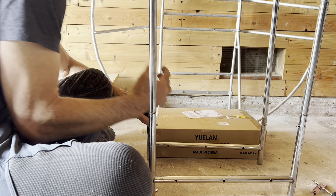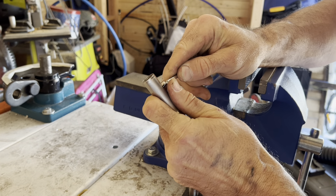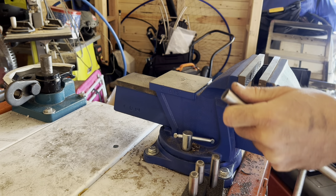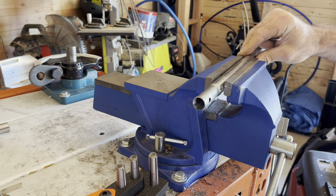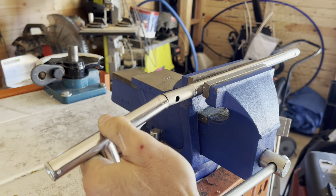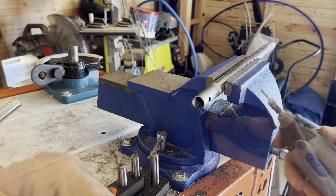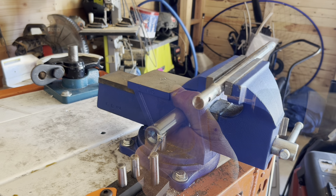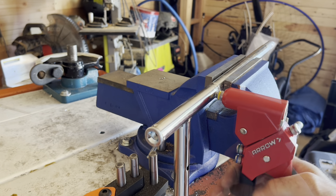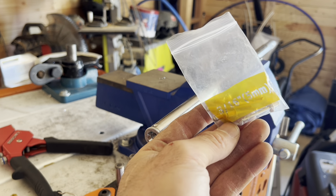After I remove those little safety buttons, I'll probably just put a rivet in it to hold it together. So I'm going to remove that little snap and save it in case I ever want to use it for something else. This stuff is extremely hard — it's going to be hard to drill into. I'm not going to try to match that hole because it may be too large for the rivet that I have. What I am going to do is try to get this thing level at a right angle. With the Dremel, I used my 3/16ths drill bit and then I put a rivet in — 3/16ths.